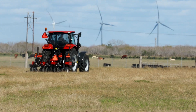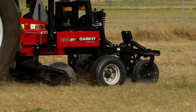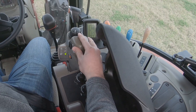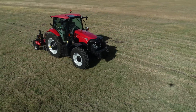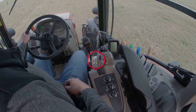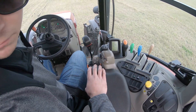This will enable you to quickly find your position if the knob is moved for any reason. Observe the implement as it moves through the field and adjust the draft sensitivity knob to match soil conditions, or until the tendency to raise and lower is satisfactory. The optimum setting will be achieved by observing the movement of the indicator lights and adjusting the sensitivity until either of the indicator lights flashes once every two or three seconds.